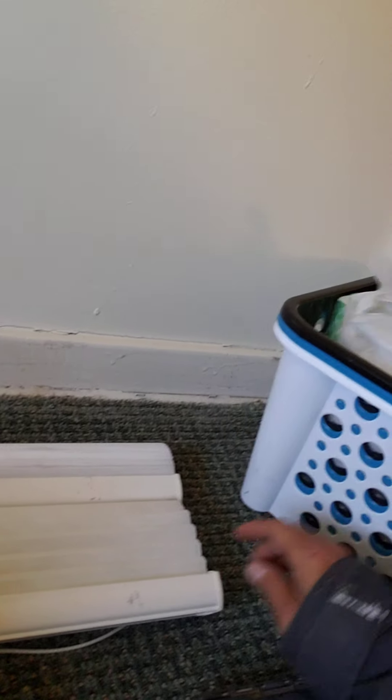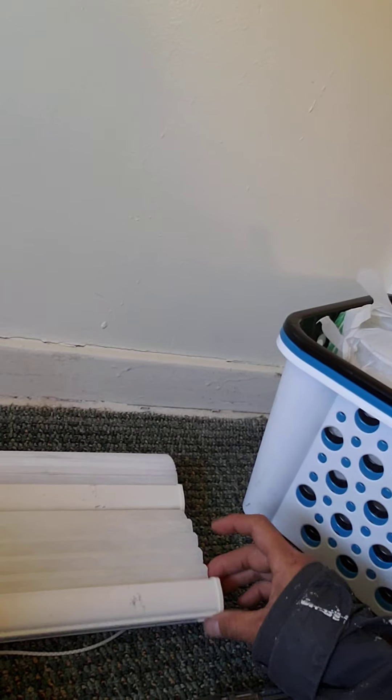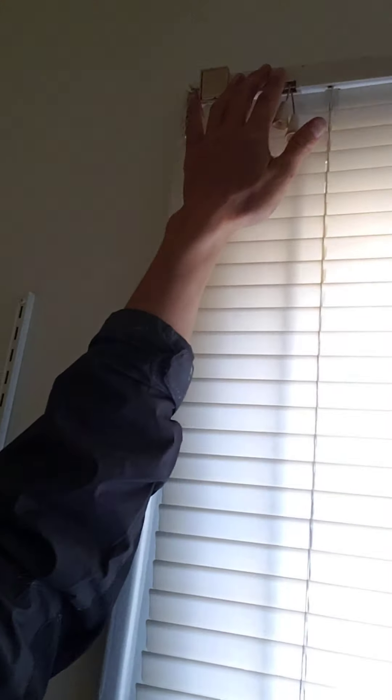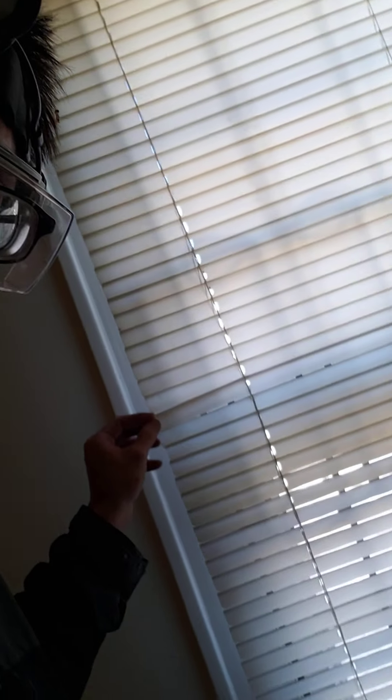Today I'm going to be cutting through a mini blind for installation. The cosmetically best approach is to put end caps on and install them into the bracket, but my hack is to drill through the metal on the back side of the blind so you don't see the hole. Instead of buying end caps — which might cost five to ten dollars each, and with ten blinds that's fifty dollars just for end caps — I drill into the back metal plate area and screw it directly in. That holds it well in place.